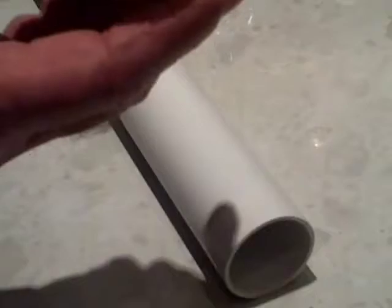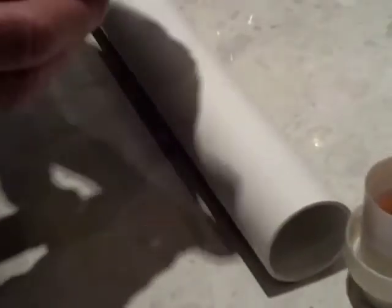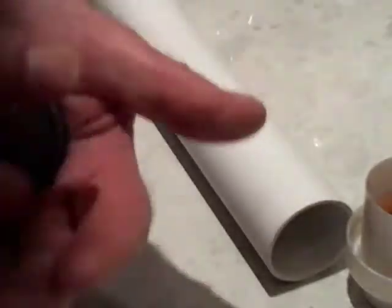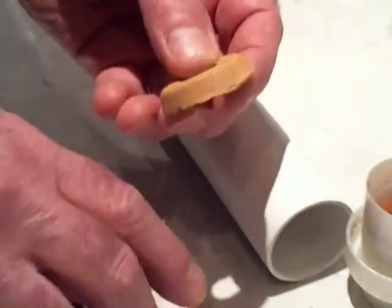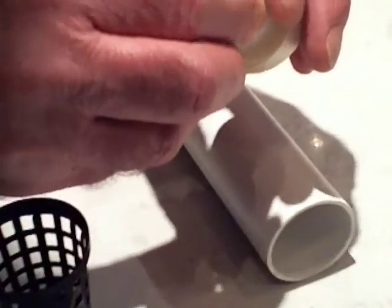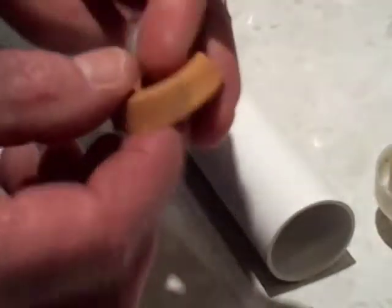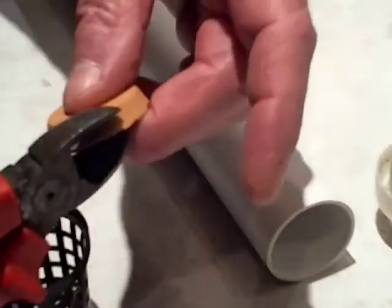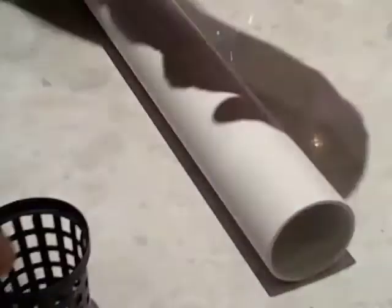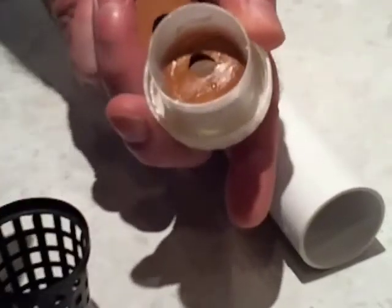Inside you'll notice that there's an orangey coloured lump. That is actually one of the weights — one of the ceramic weights that come in the plant pot when you buy your plants for the tank. You'll find that they almost fit into the lid top. There's a bit of residue around where the thing's made, and if it doesn't quite go in, don't force it because you'll crack the lid. Go around with a pair of wire cutters and just nibble off a bit of that ceramic. Then place it into the lid, get your silicon gun and fish-safe silicon, and put a bit of silicon around there to keep it in place.